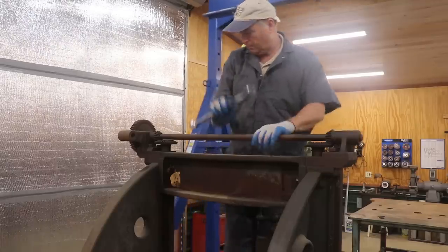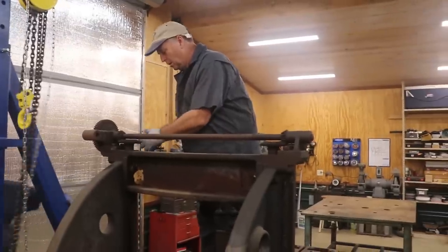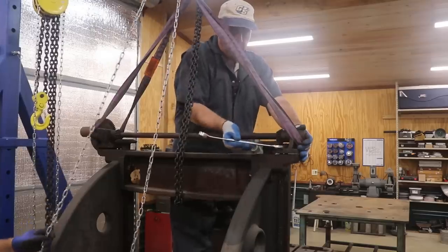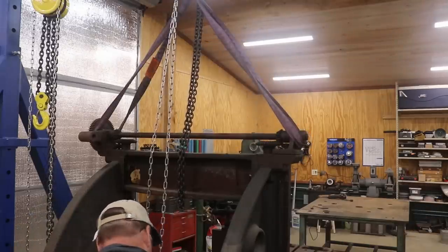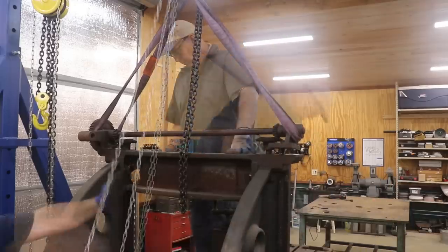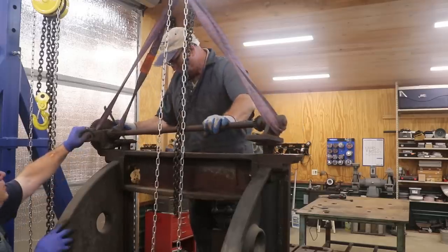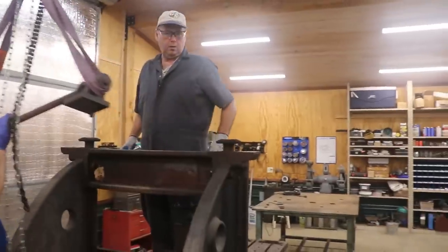Because of the way we did this with multiple people working in the shop, I wasn't doing a whole lot of narrating as we were going, so I'm going to do some voiceover here and let you know what's going on. We started out by removing this little top section across the top of the planer, and when we tried to pull it off we ran into some interference with some bevel gears. They wouldn't let us unscrew some of the bolts, so we had to go deeper into the planer and work on getting those whole rods out with the bevel gears on them. Then we were finally able to get the little top piece off — basically what that is used for is to adjust the height of the clapper box. You can adjust it up and down using those bevel gears that drive the screws.